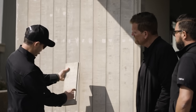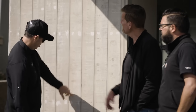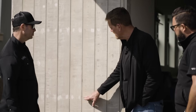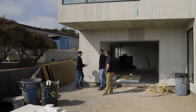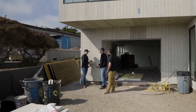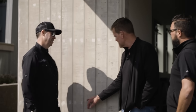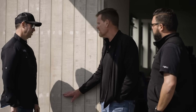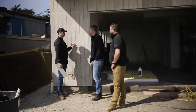I like that. You're not blind nailing — you're actually nailing where you can see the fastener. The specifications say to not blind nail, to expose the fasteners. And what are you using for nails? I suspect you're worried about those nails rusting. Correct — these are stainless steel ring shank, Grade 316 stainless nails.